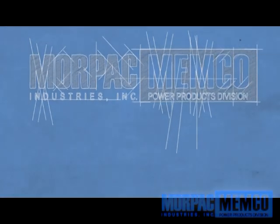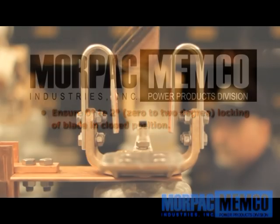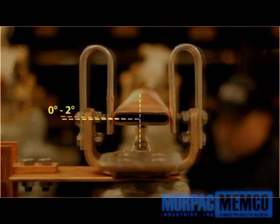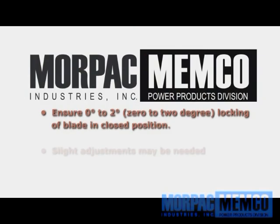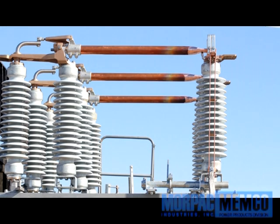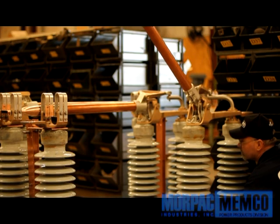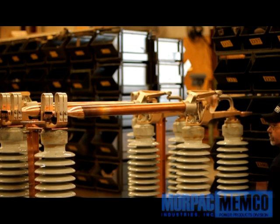The key points to observe in this testing phase are: making sure when phases close, they shut with an overturn or locking of the blade of approximately 0 to 2 degrees. If a phase or phases are not closing properly, there may be a need for some individual adjustment. Lateral inline distancing ensures that the silver contacts do not exceed or miss the contact. The lateral travel adjustment is done by adjusting the single insulator under the contact loop via the elongated mounting slots at the base of the insulator stacks. Loosening the bolts and moving the single insulator forward or backward may be necessary. However, please note that adjustment of this nature is rare as this is preset at the factory.